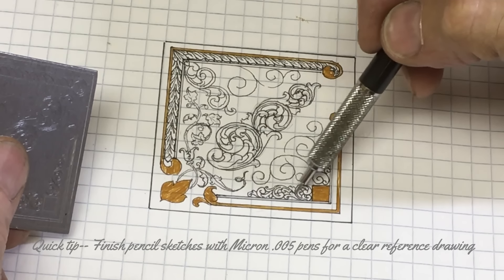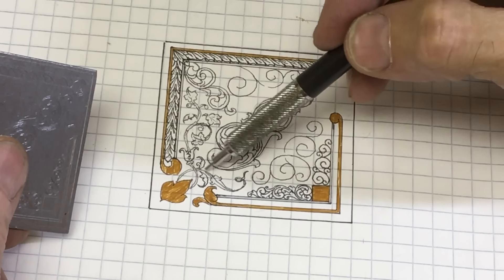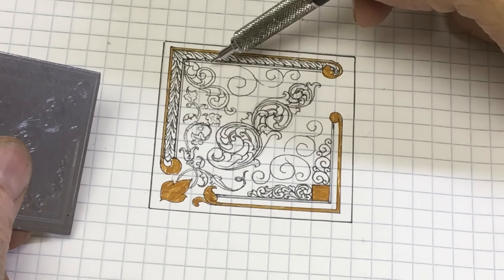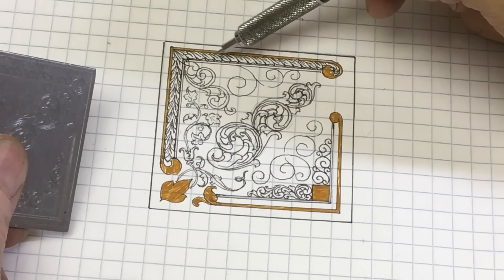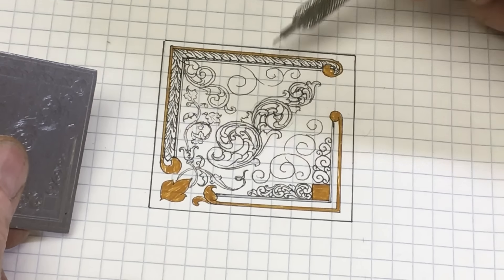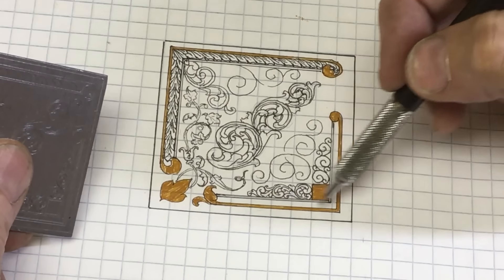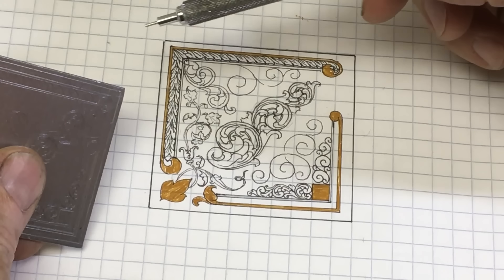This little gold square is going to be a method for setting gold into the background using a stipple tool. Next to that we've got some American scroll and some fine English scroll. Over to the left we've got some really loose vine scroll, and above it there's going to be a flare cut using a round graver and 120s for the sides. Above that we've got some borders — a running wheat border on the right side, a single leaf on the left, and a double leaf. We've also got a couple of backbones with nothing in them, so leave your suggestions in the comments below.